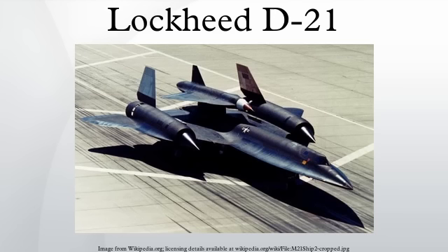Following the accident, Johnson suggested launching the D-21 from the very large Boeing B-52 Stratofortress bomber, and adding a solid rocket booster to get it up to speed. The drone was modified by adding attachment points on its spine to mate with the carrying pylon on the B-52, and its belly attachment points were adapted to accommodate the rocket booster necessary to increase its speed and allow its ramjet to operate. Its vertical stabilizer was increased in size by approximately 20%. The modified drone version was designated D-21B. Two B-52Hs were modified to carry a pair of drones each by means of two large underwing pylons that replaced the smaller pylons used for the AGM-28 Hound Dog cruise missiles.